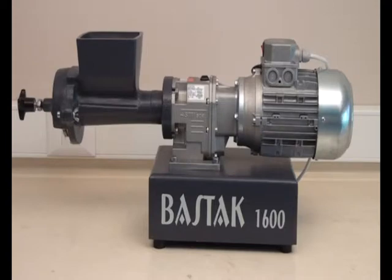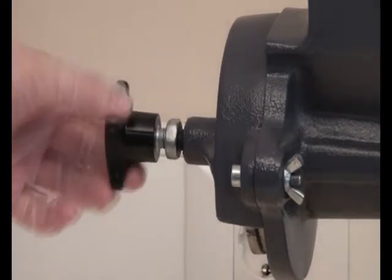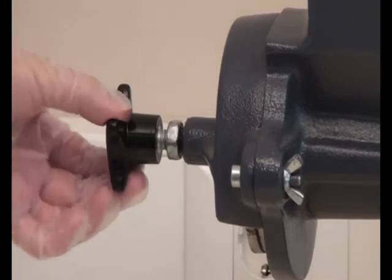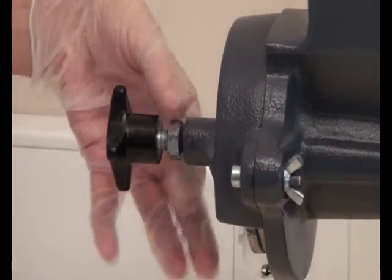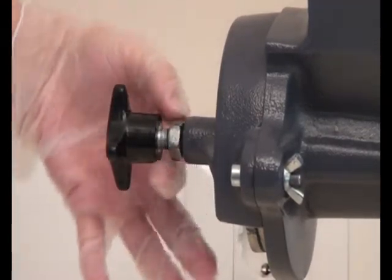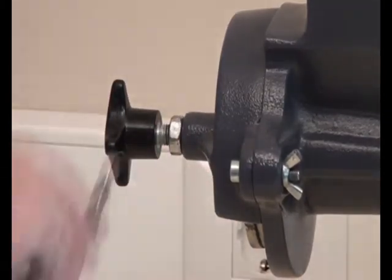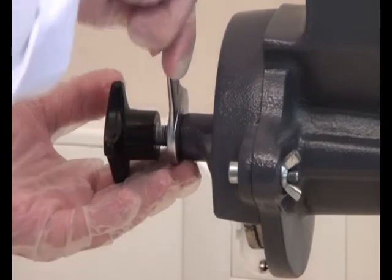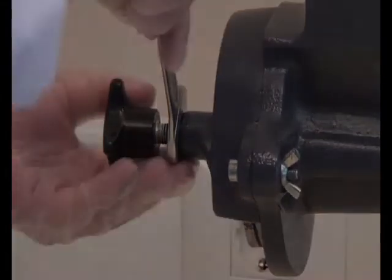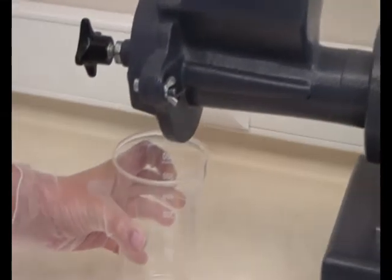The milling process does not affect the moisture amount of the sample. For any powder products, the discs should be tightened properly in order to prevent loosening of the discs — the nut should be tightened by using an open-end wrench. For milling, firstly set the collection container down and then switch on the mill.